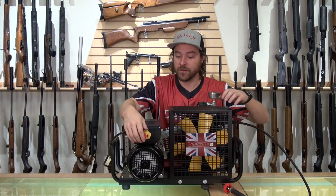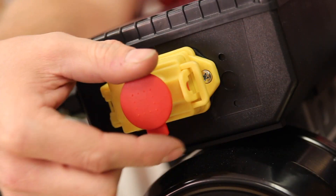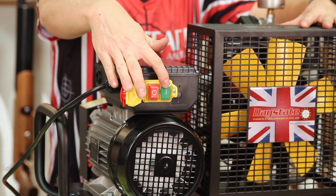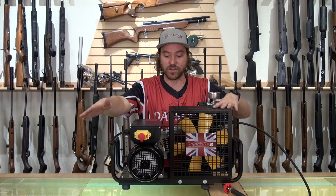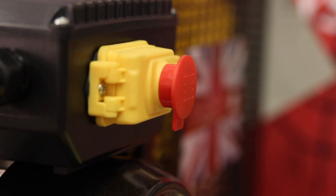On the front of the motor, you will see a big red button. On the bottom of that button there is a hinge — pull up on that and you've exposed the green and the red. Green is start, red is stop. This is a fail-safe: as soon as you latch that red button, it'll stop. If there's ever a moment you need to shut it off immediately, give it a good press — it'll latch, stay off, and won't turn back on.